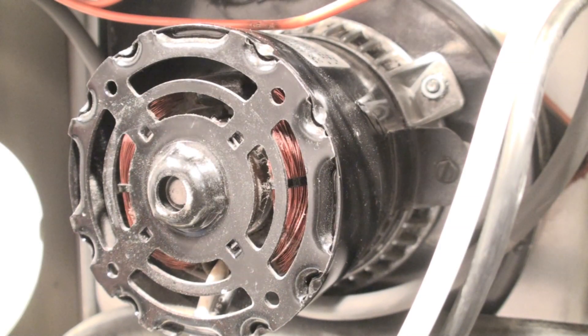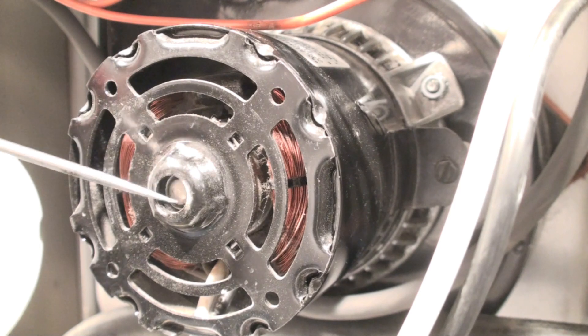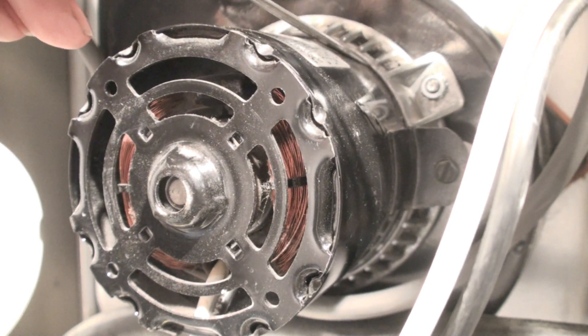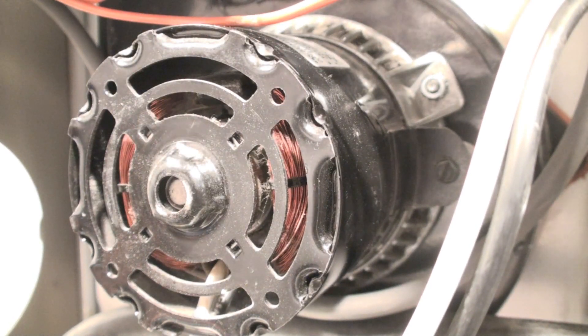Let's check a little closer — inducers usually don't run quite that hot. We have a rated load of 1.0 amps and we're drawing just a skosh over that; it's probably okay. However, we should check a little closer. These things lose their bearings. The back bearing here usually is no problem, but the front bearing on this side is where the high temperature is and that's usually the one that fails.